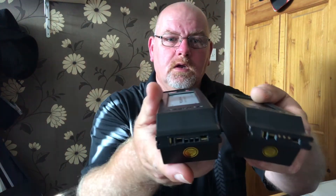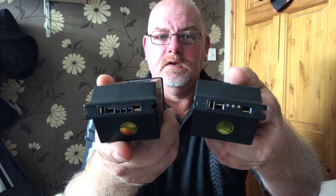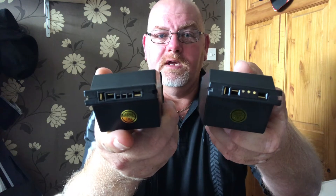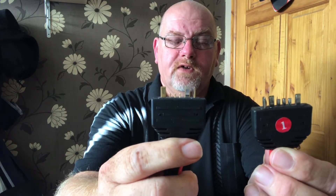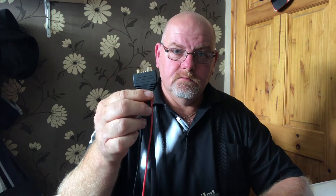Just a quick look at the physical differences: the H Plus has got mini deans in the middle, whereas the H480 battery just has plates for the balancing charging. So your old balancing leads will not fit the new H Plus. The one on the left is LiPo HV for the H Plus and the other is for the Typhoon H480. If you've got the old leads, they're no good — you can't charge the new H Plus batteries with them. You will need to buy new leads.